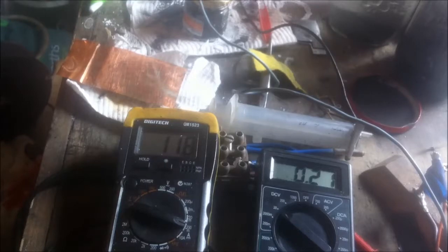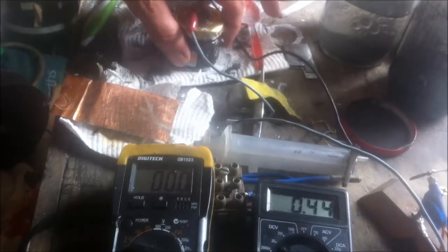Dropped just under its voltage from the last time. It was 0.22 volts when I cut the experiment at half hour, but we made it to 46 minutes, 47 minutes, 1 hour, so not much for an extra hour charge. So 2 hours maybe overcharge for a cell this size. But I'll keep charging and discharging it. I'll give it a rest for an hour and I'll commence some more charging and discharging.